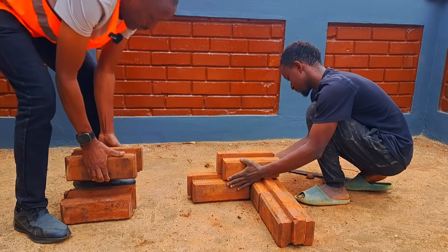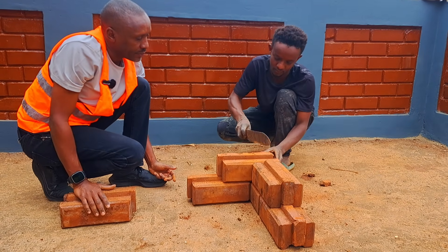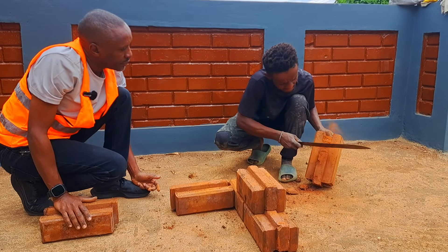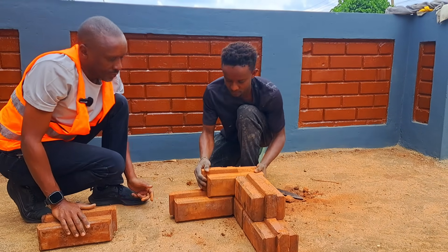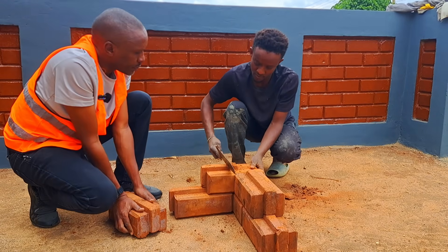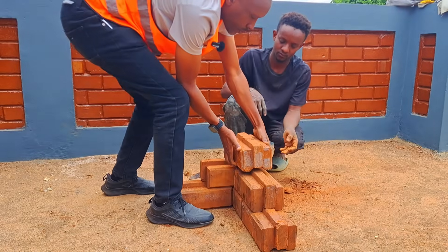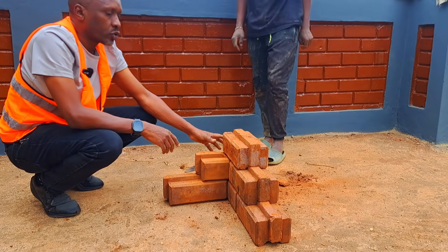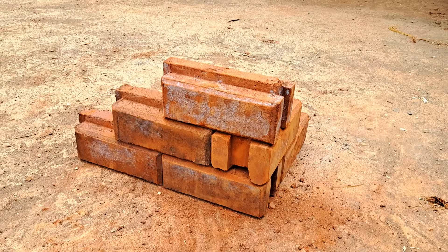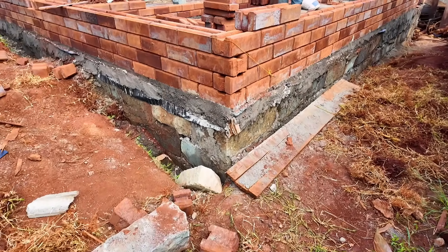After that you can run your courses — run there, there. When you get to the next course, you do the same. You follow the same sequence until you get to the beam level. This is done for every corner of the house — the same procedure is done. You only need a simple tool like a panga or any sharp object nearby. That's what you need.